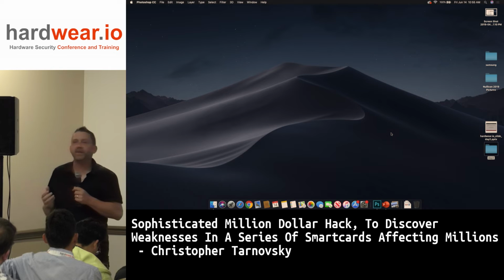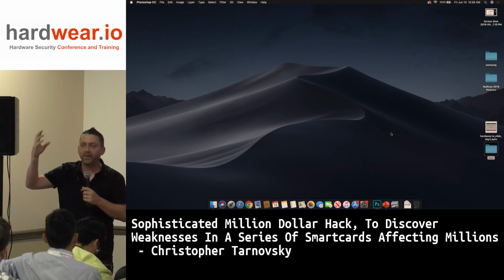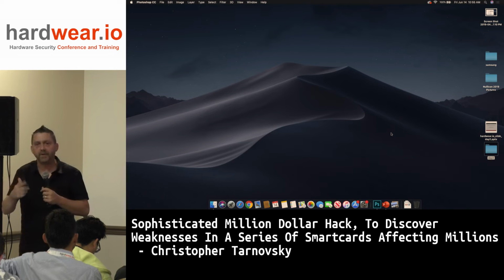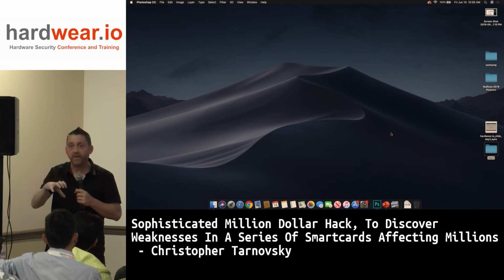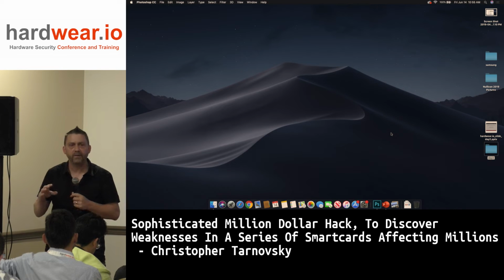And then I realized it went to this NAND, and then I saw the NAND goes to a NOR, because there were several NANDs. I think I showed you NAND 4 yesterday. So that was the fourth 4-input NAND gate that I had come across only for this area. So these alarms in that Samsung chip are everywhere. Did I answer your question? Okay.